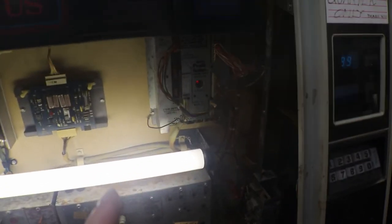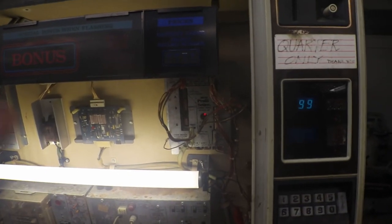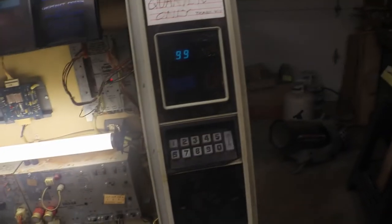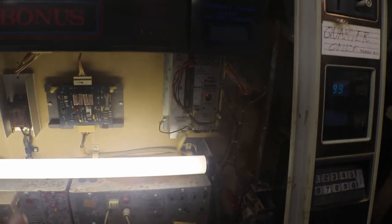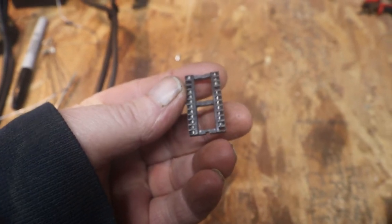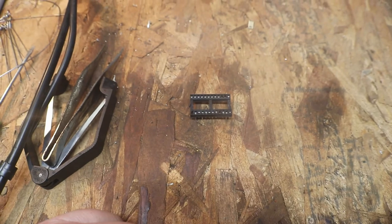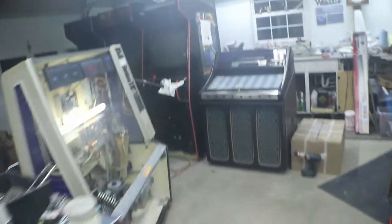That's how I think we got our keypad working partially — from me unplugging and plugging stuff back in, it moved that chip around enough that it made contact and started working the keypad partially. I had pulled that chip out and cleaned it once before, but I didn't inspect the socket well enough. This time, since we were having such problems, I really inspected that socket when I pulled that chip. I narrowed it down and traced it back to that chip controlling things for the keypad. Once I pulled the chip and started looking at it, I could see the socket was corroded — some of the pins, or the contact latches, were collapsed. So we weren't making good enough contact on that chip. Once I changed that socket, everything started working.